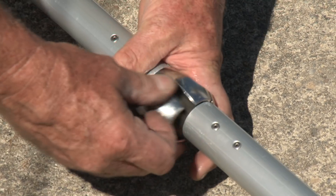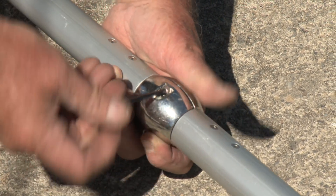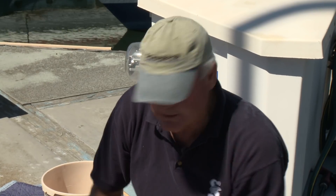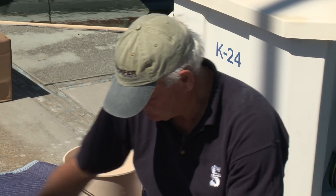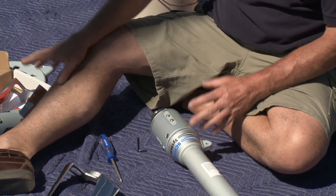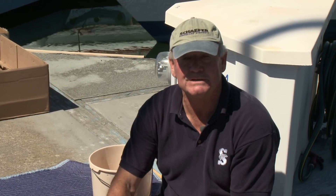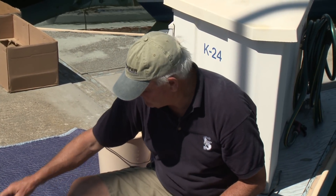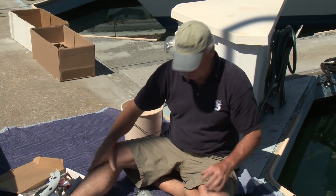We can put the feeder on now since we'll only need to slide the torque tube up enough to adjust the turnbuckle later. We're going to put the top and bottom drum plates on after it's on board. The stainless steel cage goes back on afterwards — it's just better not to risk scratching it while getting the assembly up to the stem head. At this point we clean up, organize, and we have a friend going up the mast to connect it to the mast tip.